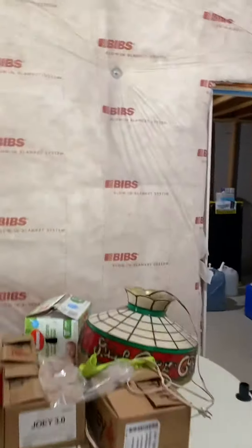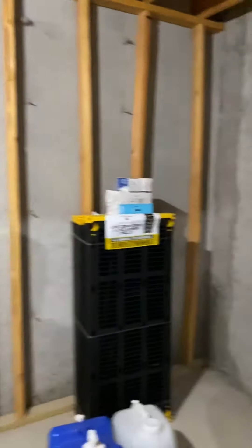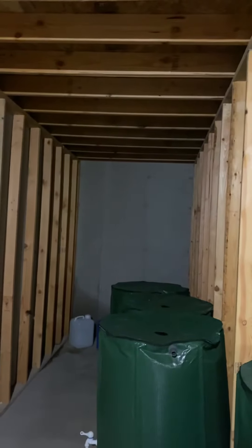We're here in Linden with Lindsey and Steven Swayze. We're going to be doing a ProMax 48K. Water hardness is 26, water pressure is 45, and then dropping about 7 PSI.